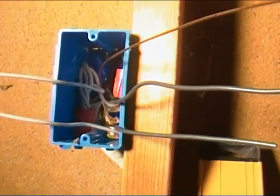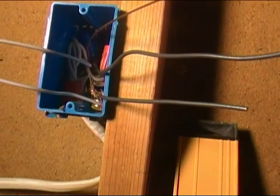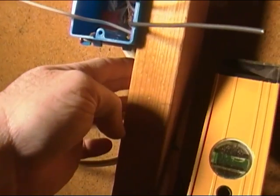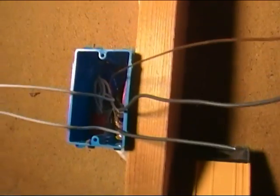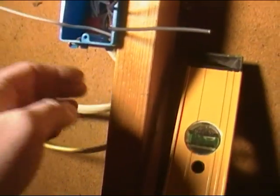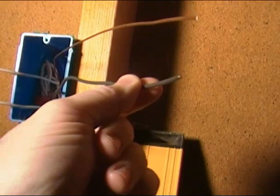From that point, we've done the same thing with the black wire, which is the hot wire. We took the black wire from this one and the black wire from the existing one, plus a short extra piece of black wire cut from some wiring, stripped it back, and twisted all three together. Then pushed that bundle to the back of the box, leaving a single black pigtail wire coming out.